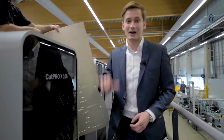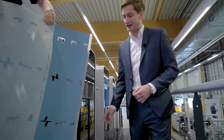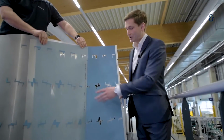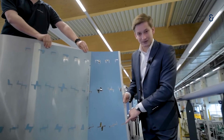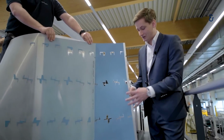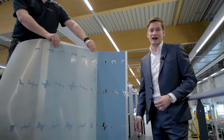And the final step is our stripping unit, and here we are working with coating plates. These coating plates are cut on our own cutting plotter, and you can see male and female, and our female plate has those vacuum chambers where we push in the waste pieces, suck it to the cylinder, and on side 2 we can extract them out of the machine.